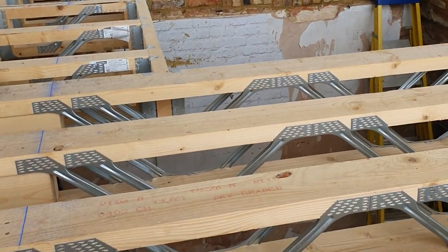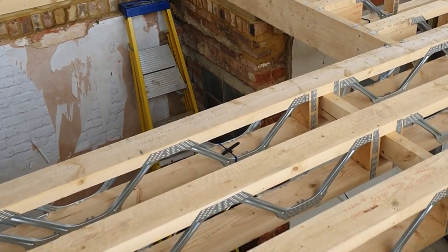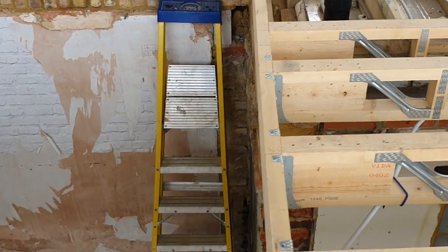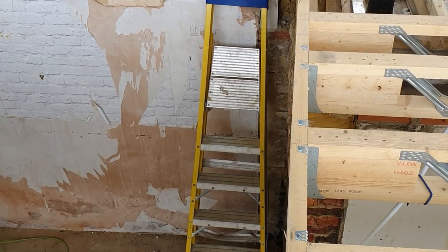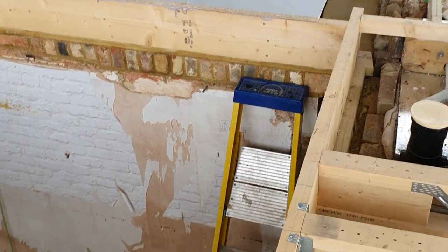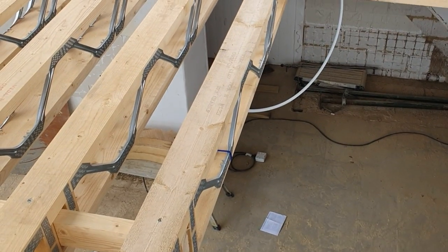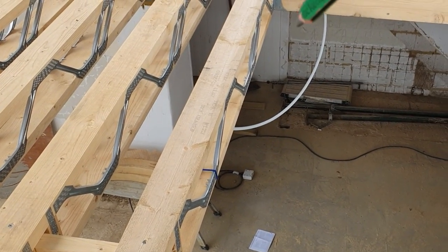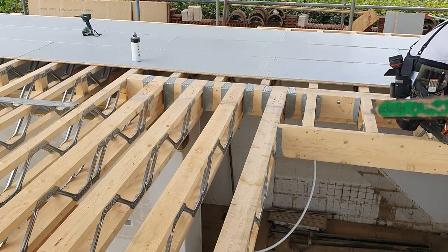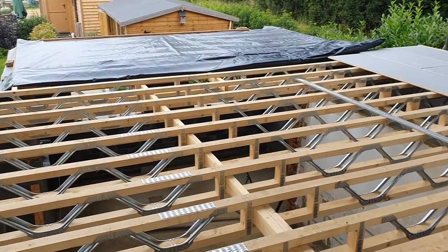Around the stairwell, although we know roughly where the staircase will finish, we're going to fly the boards over a little bit so we've got some tolerance to cut them back. One side is a given and goes flush, and the stairs are effectively against those two walls. On this side going through, I'll probably hang them over a little bit just in case we need to retrim to match the staircase width. On the other end we'll overshoot a bit in case we need adjustment on the nose. We can always cut it back afterwards — so we're going to get this end finished now.